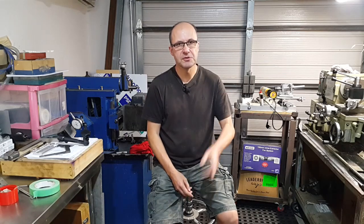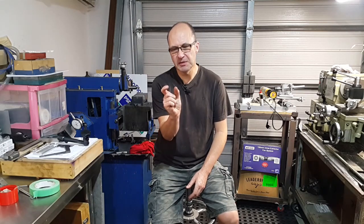Hi and welcome back. In this video I want to have a look at the horizontal bandsaw. At the moment the blade is quite a fair way back from where the jaws finish, so if I try and hold a short piece of stock — something I want to cut, like if I've machined something and want to cut the back off — I just can't hold it very easily. So what I'm going to do is extend the jaws and fix those to the existing jaws, which is going to improve that situation a lot.